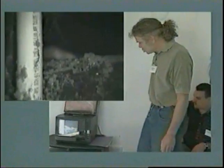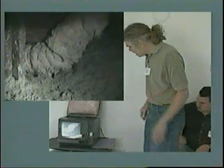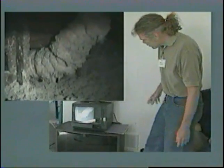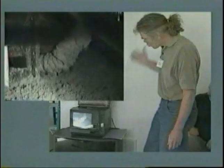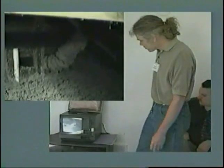We also found a ceiling fan in there that was actually dumping moisture right into the attic area. So we've extended the duct work to the exterior, and it's also insulated so it's a nice warm path. That way we don't have condensation in the duct dumping back down through the fan.